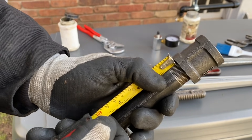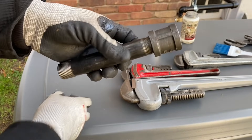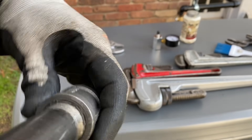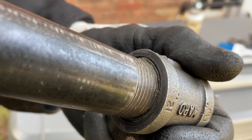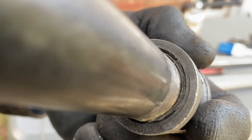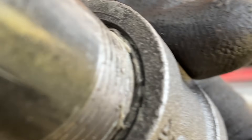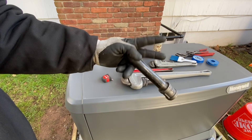Now that went in further. Not much, but it did go in a little further. It does lubricate a little, but it also seals — because as you can see, it's compacted right here where I stopped turning it in. It's all compacted and packed up tight, and that's what it does — it packs itself up tight as you're tightening it. I hope I was able to help explain how to properly seal gas pipe. Enjoy the video — till next time, I'm out. Peace.